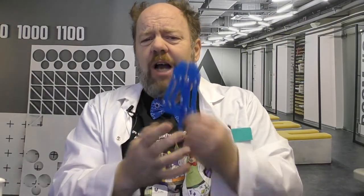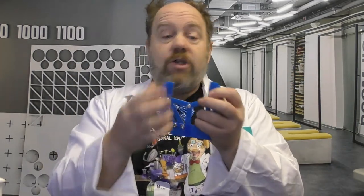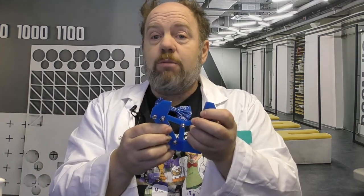Picking up a raw chicken egg with a robot gripper is not an easy task. The first point I'd like to make, though the challengers have probably thought about this already, is having soft rubber-tipped fingers on your gripper which have a lot of traction with smooth surfaces like the surface of an egg. This allows you to apply the minimum pressure to hold the egg.